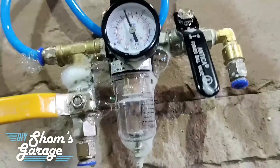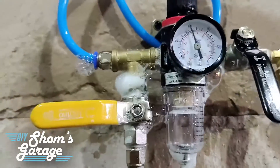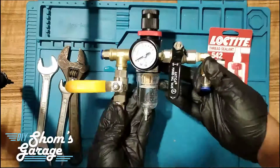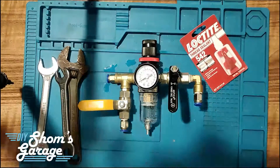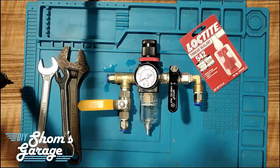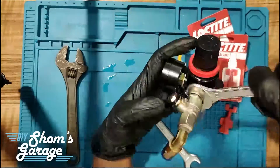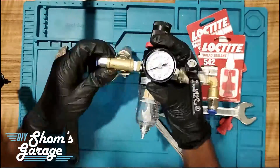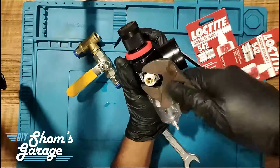In this video we are going to look at how these leaks can be solved and stopped permanently. As I mentioned earlier, we had used Teflon tape on all the parts. However, in this video we'll be using Loctite 542, which is a thread sealing compound, and it is much better suited for high pressure applications and for sealing threads, especially in hydraulic or pneumatic air systems.